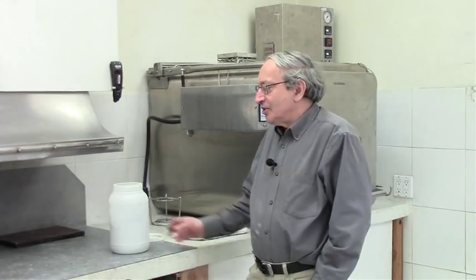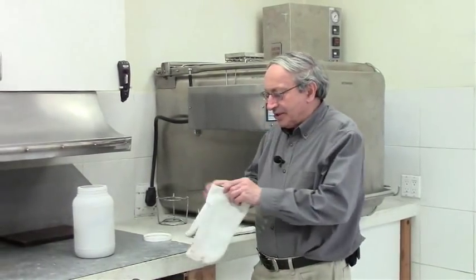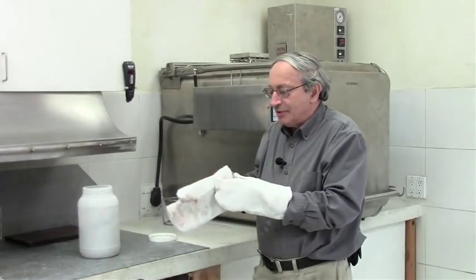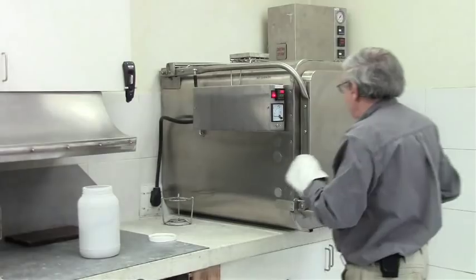And so altogether, a much better solution is to use the paint itself to fill a defect. So what you do is you heat up the part to about 230 degrees C, the same temperature as for painting, and while the part is hot, you just sprinkle some powder from the same powder you use for painting into the defect. The paint will melt and fill the defect. So let's do that.